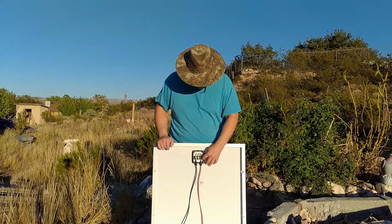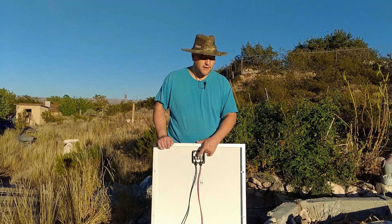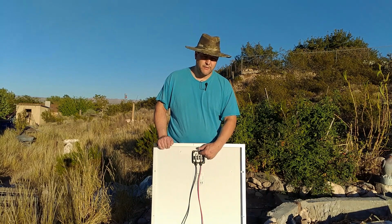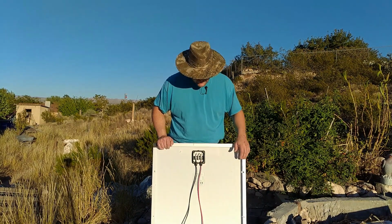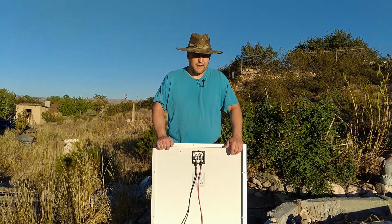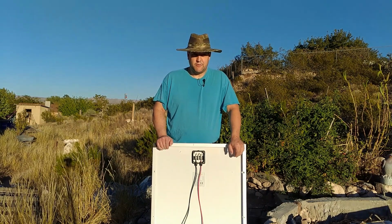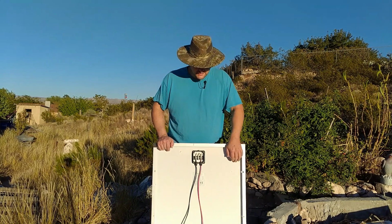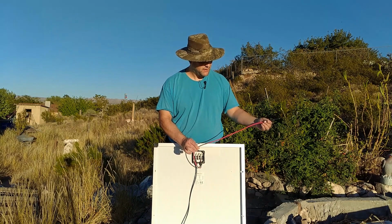So I actually went in, redid these, crimped them down, and then soldered them up. I also altered the way the nickel tabs here were coming out of the solar panels and connected in, and resoldered the joints for the bypass diodes. Yes, I'm rather OCD. I like to make certain things a certain way a lot of times, and probably for most people it won't matter. But for me, since I was already in there, I was like, I'm going to go fix this.